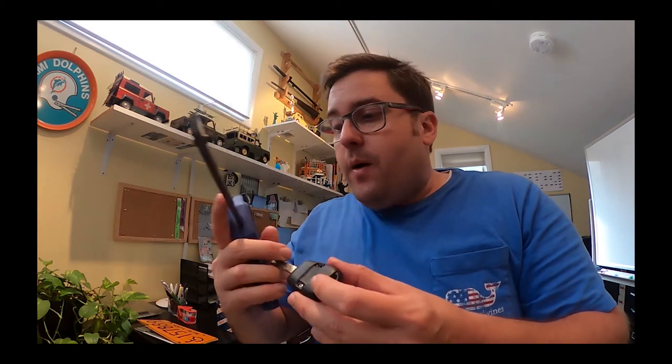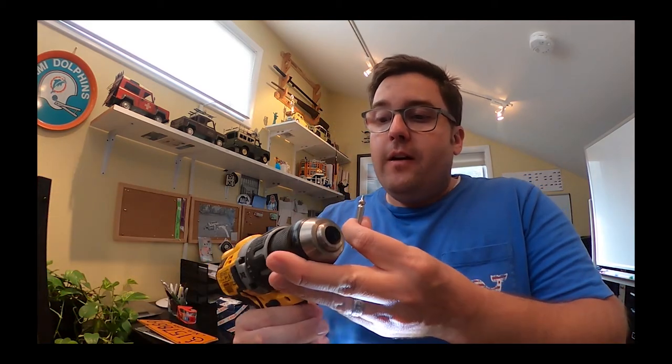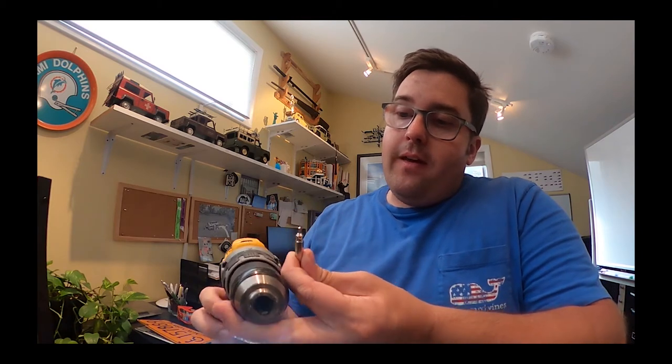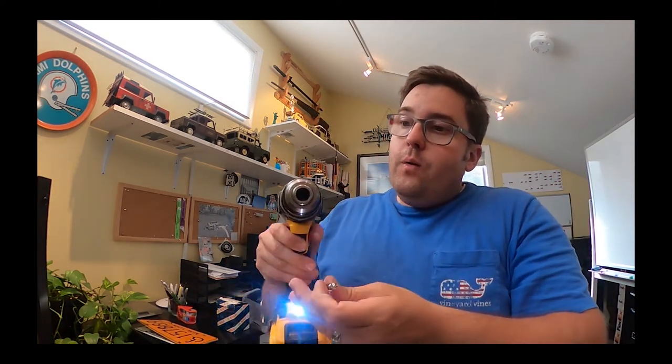So I did a lot of research about how I'm going to fix this. You could obviously take a drill and start drilling it out, or you could try to notch it and then use a Phillips head screwdriver after you put a notch in it to loosen it up. But I found something called Easy Out — it claims to be a broken bolt and screw extractor in various sizes. The smallest size is this one, and you put your screw gun in reverse mode, going counterclockwise.